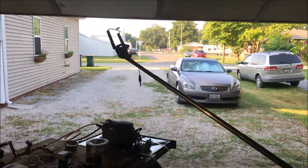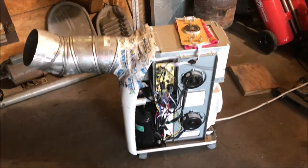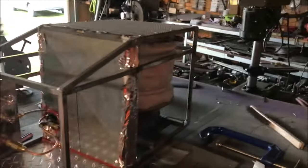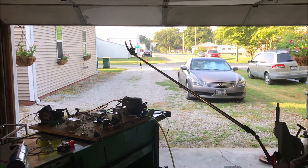It's my bedtime — the sun's coming up. When I'm welding I've got to wear this little hat so I don't get burnt from hot metal landing on my skull, big gloves, and a welding mask — which I had lost but there it is over there. When it's 85 degrees out, forget about it. With MIG welding you can't have the slightest breeze because your torch uses a shielding gas, so I don't get to use my fan. That's why I work at night — it's just too hot during the day. I work till about noon sometimes when it's just unbearable, then fall asleep and do it all over again.